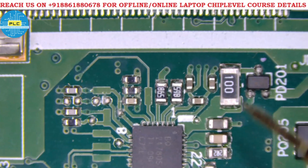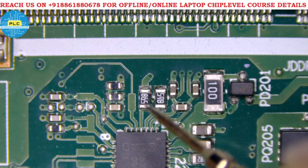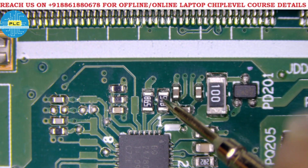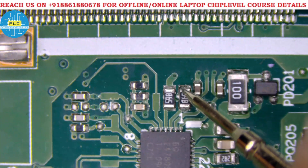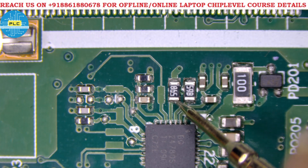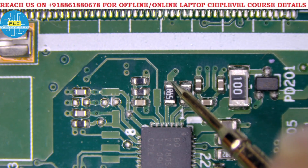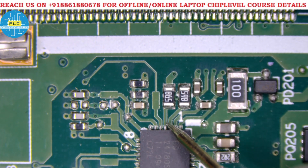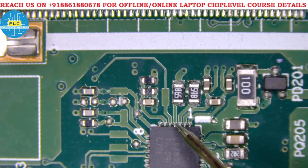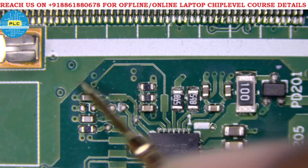The supply pin — pin number three is CMSRC. The two MOSFET sources will connect to pin three through a resistor — 4.7 kilohms. Both resistors are the same value, confirming pin three is CMSRC. Next, pin four is AC drive. The gate voltage for both MOSFETs is driven from pin four — AC drive — and from this connector the first and second MOSFET gate voltages pass.